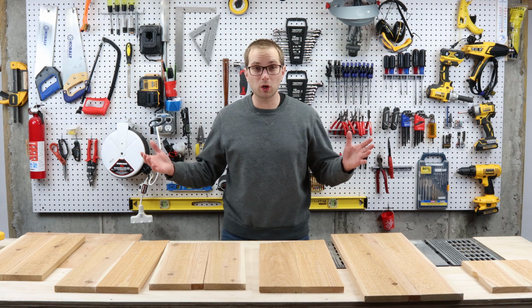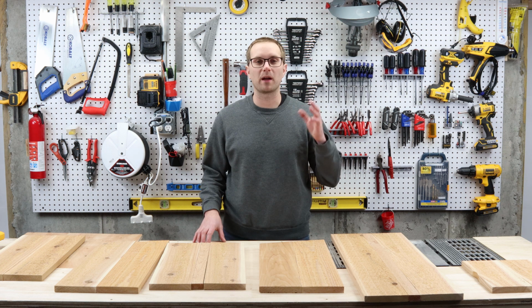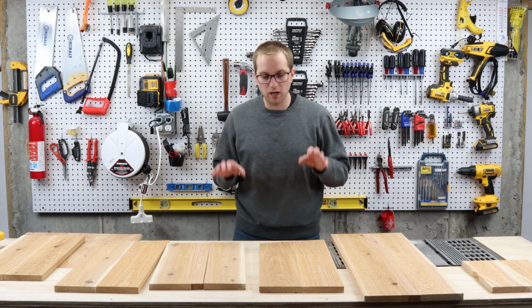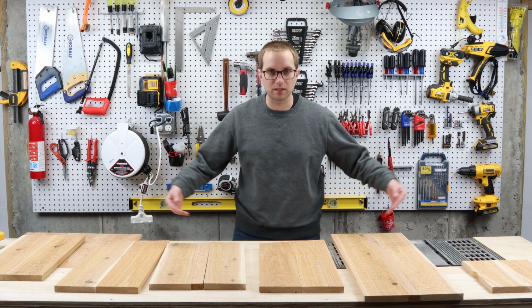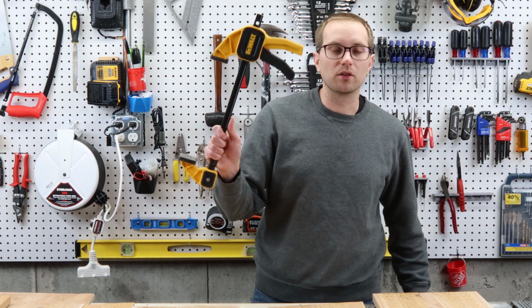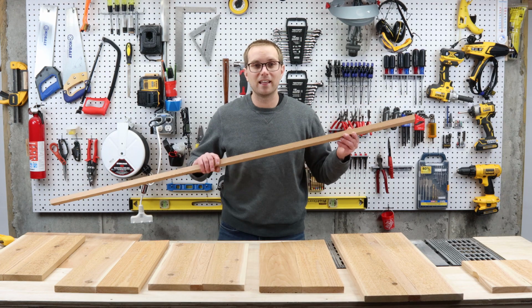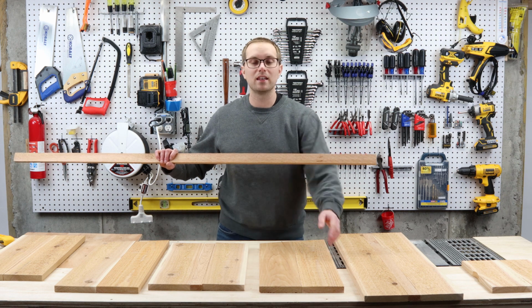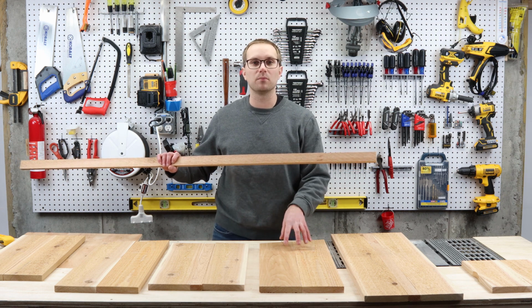Well, that was super cold, but I'm finished doing all of my rough cuts. I only made a few mistakes. They're going to be totally manageable. Unfortunately, I don't have enough clamps to simply clamp the boards together and glue down the center. I should have bought about 100 more of these when I had the chance. Instead, what I'll do is cut apart strips of cedar, glue those down, nail them in place, and use that to let the boards set.